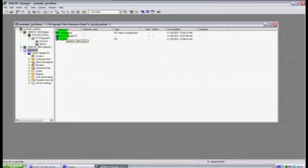You'll also notice that while it's configured it, it's put in here WinCC Flexible RT. RT is runtime, and when you download to your screen the RT, the best way of explaining it is it's a compiled version of your WinCC project. And that compiled version is the thing that is going to run. It's like an execute file. That is the bit that's actually going to run on your HMI itself. Alright, so there we go.